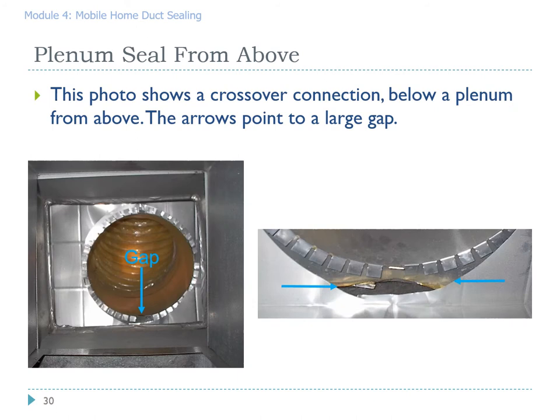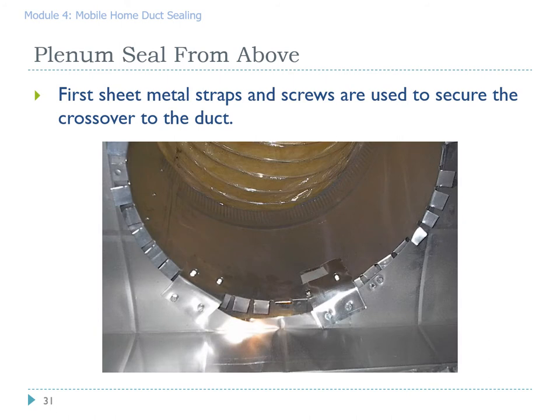If your professional licenses allow you, you can unplug the furnace fan and in many cases disconnect the heating elements also. Taking out the fan and disconnecting the heating elements gives you access to the furnace to plenum connection — and in this case, because the crossover is directly beneath the furnace, also to the start of the crossover takeoff. As the picture shows, there are some large gaps all around this area. To cover them, you can use self-adhesive sheetrock tape, or in this case we cut small pieces of aluminum valley flashing to make a stronger patch.